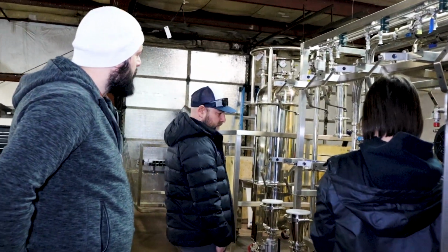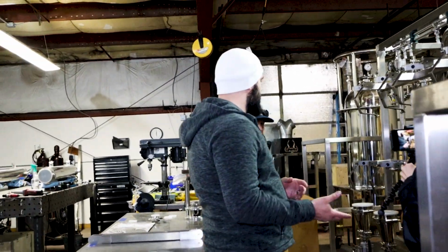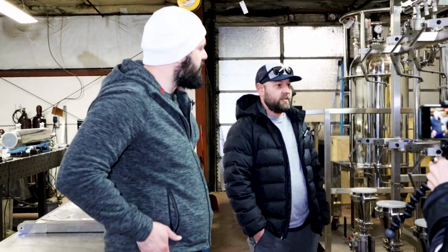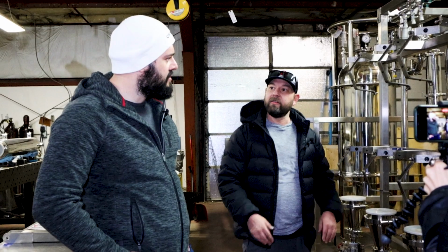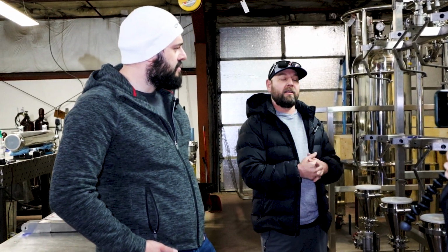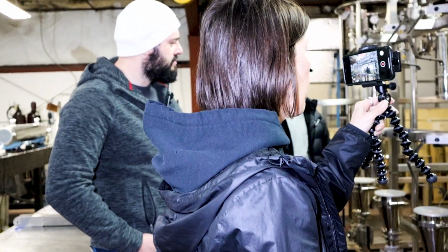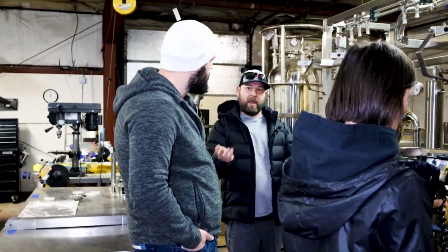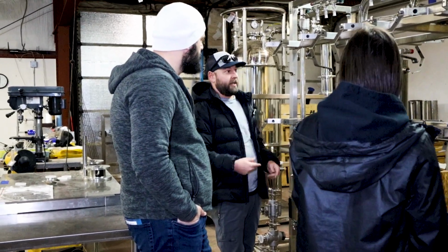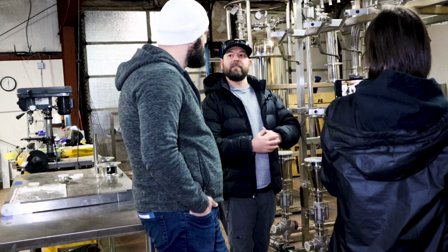That's cool. Awesome. Can you tell me a little bit about the cooling system? I guess, how you run it off of a Corken, but where does it exchange the heat? How does it exchange the heat? It really kind of runs on itself. It's designed off a traditional refrigeration system, but we've taken it a step further. It's part of our patent, and what makes it unique is most people can probably figure out how to get the propane to negative 40, but then what ends up happening is you're just re-injecting this liquid and it gets hot on you again. So we've figured out a way to keep it cold all the time, and so we go a step beyond traditional refrigeration.